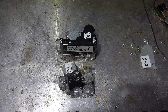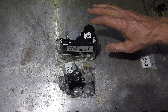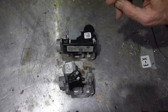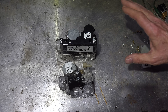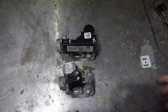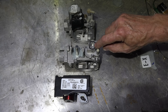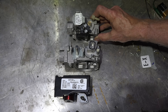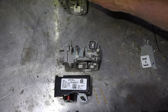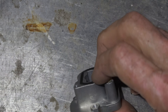This video is not about how these regulators work, so I'm not going to go further on that — maybe I'll link a regulator video. Suffice it to say, we are taking a pilot gas and changing that pilot gas pressure to increase or decrease the manifold pressure. With this top taken off you can see there's something going on here, in just about the same place as on the Gemini valve, and our adjustment on this valve is right here.